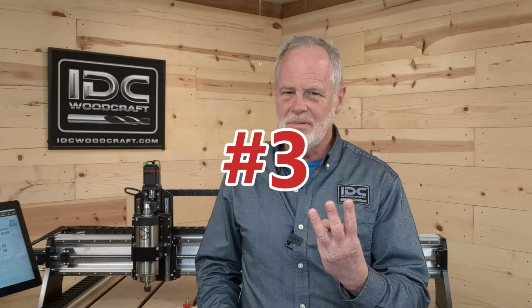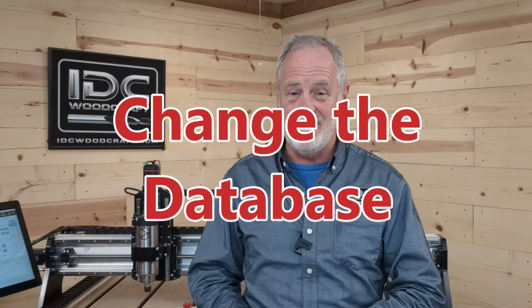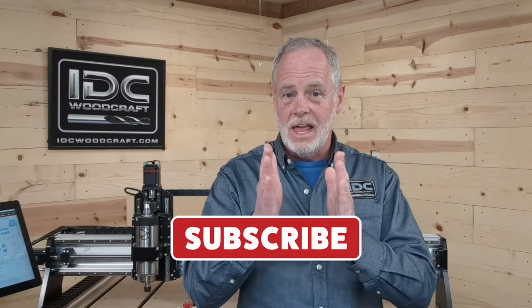Technique number 3, and this is a sneaky one. Change the data for the roughing tool in your CNC router bit database. If your roughing tool cuts at a 1/4 inch diameter and you set in your database that it's actually a 5/16 diameter tool, then the software is automatically going to compensate for a 5/16 diameter tool instead of a 1/4 inch diameter tool when it generates the tool path. And it will automatically leave a little bit of material left on that finished cut line. Then when you create your second tool path, the router bit that you're going to do the finish cut with is already set properly. Then you will have everything set up. I'll show you how to do this little sneaky thing.